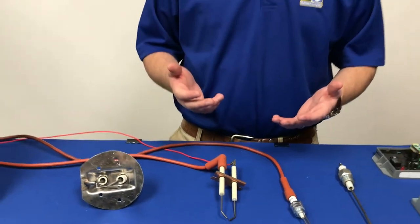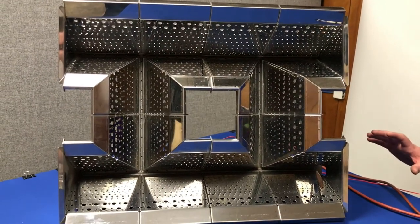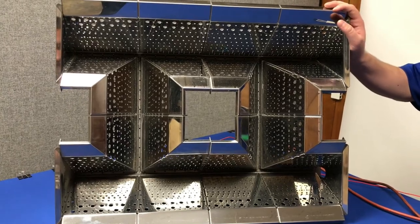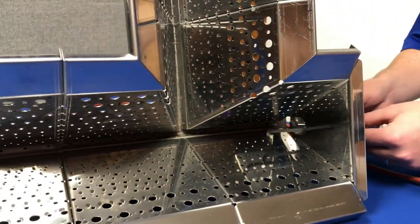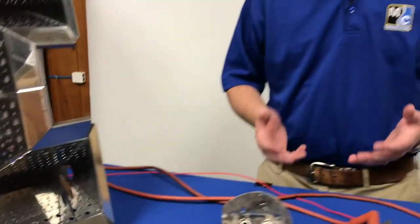Assuming you're getting spark, we already know we have fuel coming out of the burner, but let's make sure that we have enough fuel right next to the spark plug. If we look at our burner here — this is a Midco burner, and we've used different varieties throughout the years, but they all have similar concepts. If we look inside, there are several holes down on the pipe on the inside where the fuel comes out. When we mount the flame sense probe and igniter assembly, we can see that the igniter is only really by a couple of fuel ports. You'll want to make sure that those fuel ports are not blocked and that you're getting sufficient fuel out of them to get right next to the igniter.